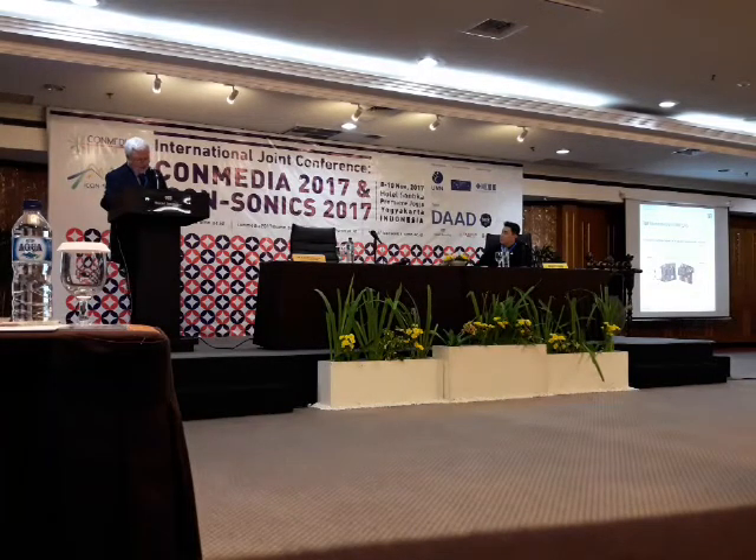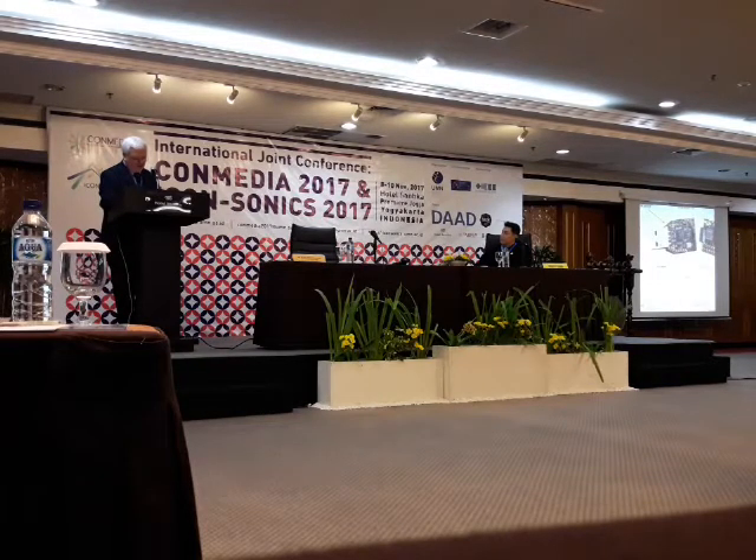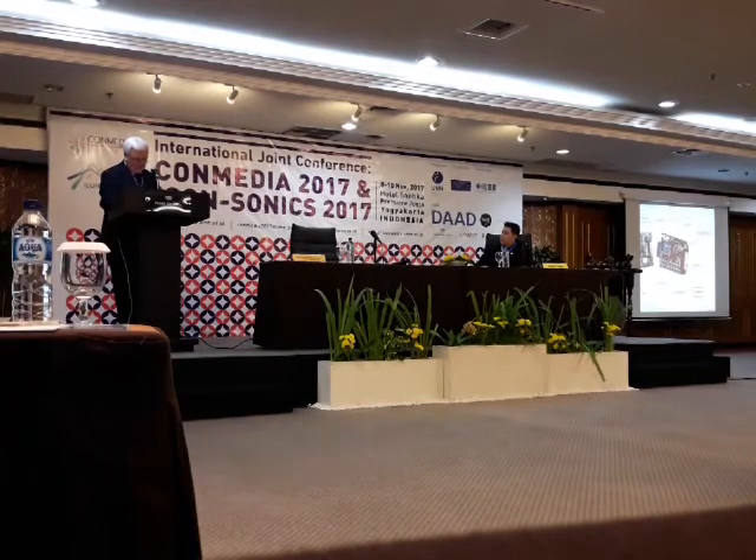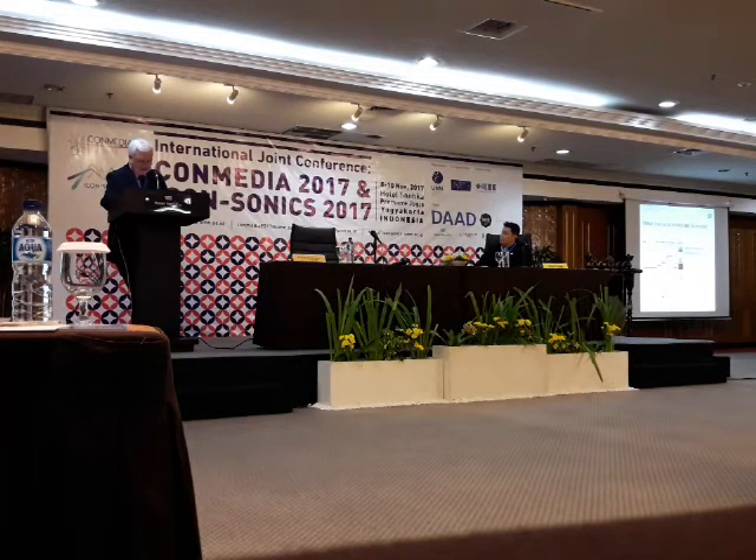We have tested that in an environment with a Texas Instruments device. We have a receiver, as you can see over here — the receiver is powered by a USB, and the transmitter is powered by the energy harvester. This was positioned in the ground and the receiver was placed in the room. After that, we measured the transmission, and you can see the voltage. It requires an energy of about 175 mW seconds.